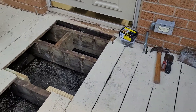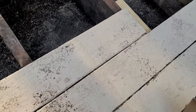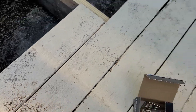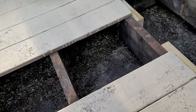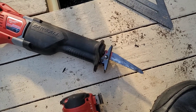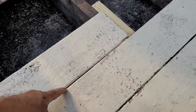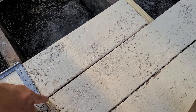As far as taking out the deck, you start by using a putty knife — insert it right in the joint until you hit the stud, mark it with a pencil, and then use the Swanson speed square. You lay it across right next to the joist where your pencil mark is, pencil mark it, and then cut it with a sawzall. I used a sawzall with a plunge cut — I put it in, cut a circle with plenty of room to spare, then back-cut this side straight and turned it around and finished the cut along the joists.